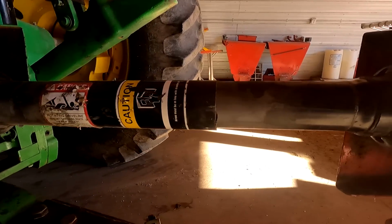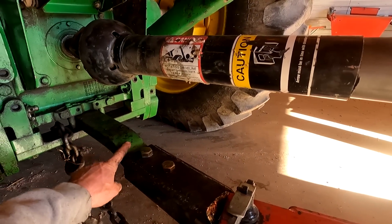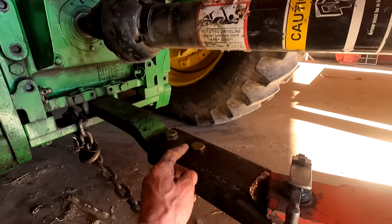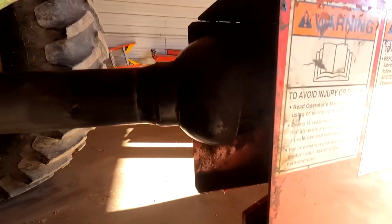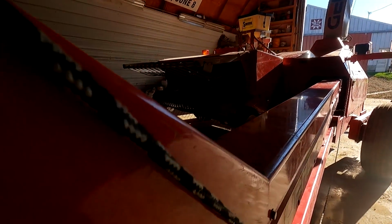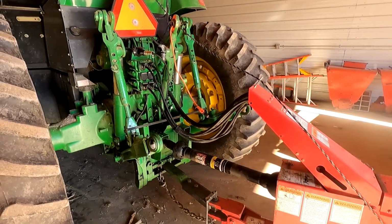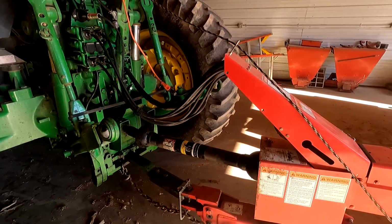I mean, there's different ways they can do this, but it's too bad my drawbar isn't longer, that I could just pull it out that far and not have to have this piece added in. But it's real simple to put in, just two bolts and double nutted under there. So, you know, things like that kind of make a simple machine a little more complex, but you gotta have it, and seems like we're getting good results.